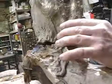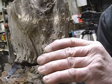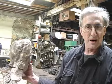Metal going from a molten state to a solid state shrinks. It tends to warp a casting, distort it slightly, twist it, bend it. The alignment is anything but a given. There are a lot of places along the way, when you get this far with putting something in metal, where the form can begin to vary around seam lines, around edges.